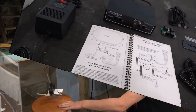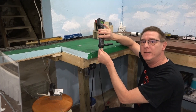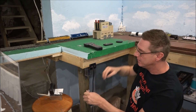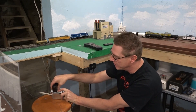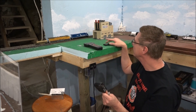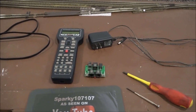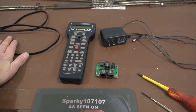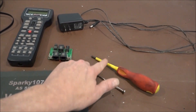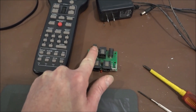The first thing you want to do is disconnect your system from your layout. With this system you can disconnect the cord so the power is off the tracks, but you still have power to the unit itself. So make sure when you're doing any electrical work, you unplug the power source first — now it's safe to mess with the wiring and you're not going to get electrocuted. Here's the 2-amp system, the Power Cab, disconnected from the layout: the panel, flat cord with 6 wires, Power Cab, and power supply. You'll need a Phillips screwdriver to take the faceplate off, and a small slot screwdriver to take out the feeds that go to your track.